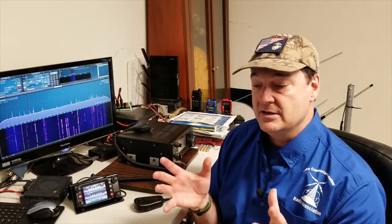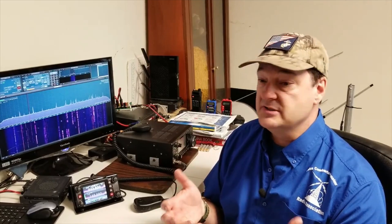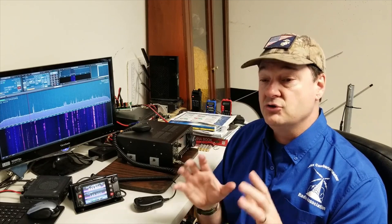That Comet GP3 is the same one I use at the house for the 2-meter band when I check in with the nets. Everything is already clear, and hopefully you could tell just a little bit of a difference with the digital. For folks who only have analog radios, when we're talking on digital on the 70-centimeter repeater, they're only going to hear a buzzing mechanical noise — they won't be able to hear our conversation. In a low-tech way, it's somewhat of a security feature. Anyone with a digital C4FM Fusion-based radio will be able to hear us, but D-Star, DMR, and other digital options won't decode it unless they're using a hotspot that can do them all.